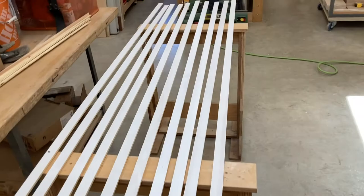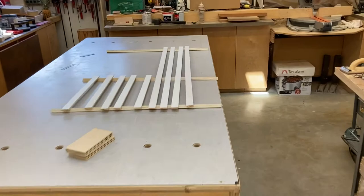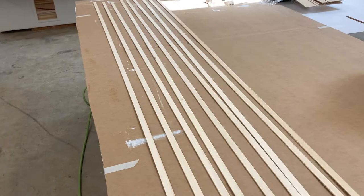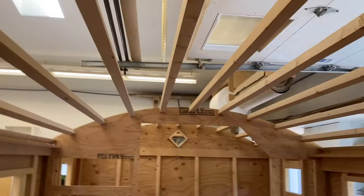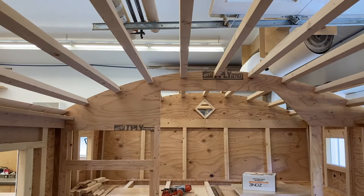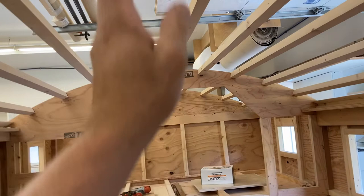I've got a first coat on my primed molding. While that dries — although it's probably pretty dry — I'm going to put the furring strips on my rafters. I laid them out here so I can just lay a little bead of yellow glue, then tack them onto my rafters with three-quarter inch brad nails, just a few until the glue sets. Once my interior ceiling panels go on, they'll be fastened going straight through again.